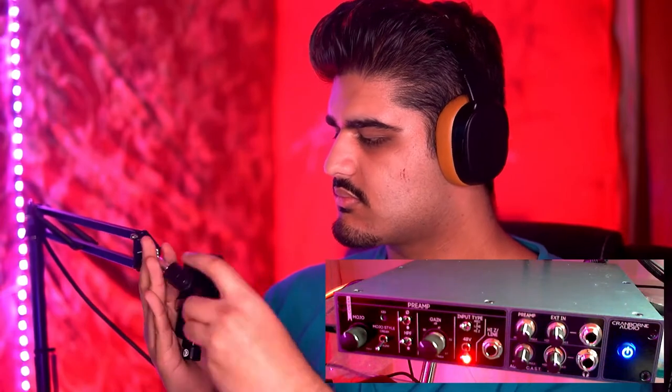So now let me swap over to the next microphone, the Neumann TLM 102. Okay, this is way quieter — maybe because it's a bit further from my mouth. 30 decibels seems to not be enough for this. Let's click that one up higher. I think these are getting similar levels to the TLM 103 now — just one click up, which is in between 30 and 41, so around 36 decibels for the Neumann TLM 102.